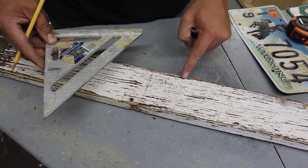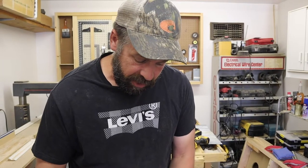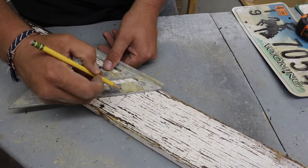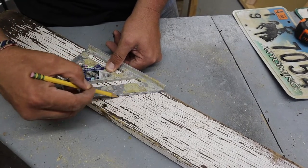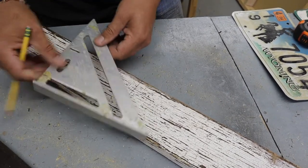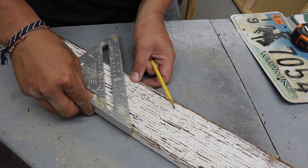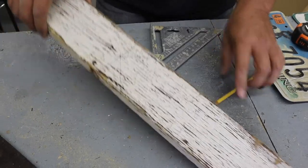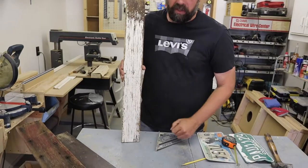Now from that point, we want to put a couple of 45s with a pitch on the roof. We could do a more shallow pitched roof, but I like 45 — it gives it a real nice look. So from that midpoint, hit 1 and 7 eighths and draw a line. Do the same thing for the other side, just using a speed square here. Now that will be the front of the birdhouse facing you, and that will be the pitch on the roof.